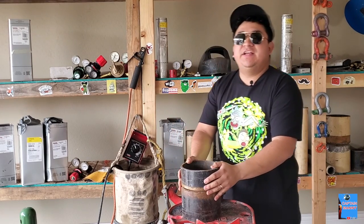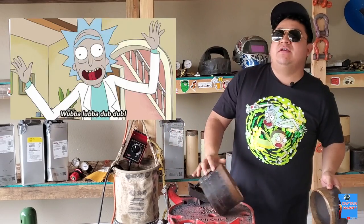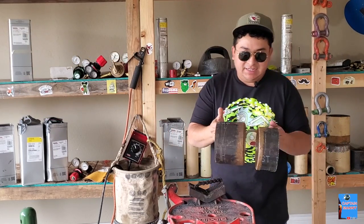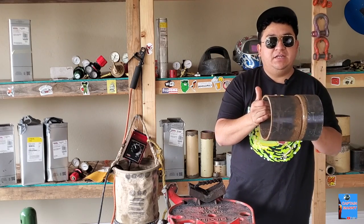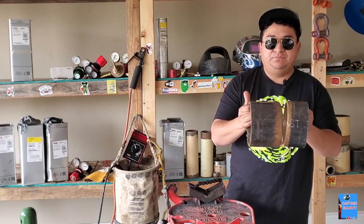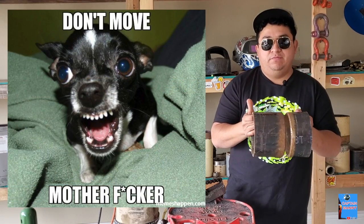All right, today's video, guys, we're gonna do the 5G. What does that mean? 5G is a set position, so the pipe is not gonna move once you tack it. You're gonna put it in position at any height you want, but the pipe is not gonna move from where you put it.